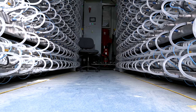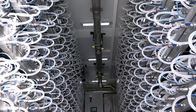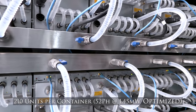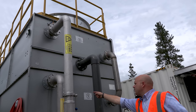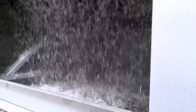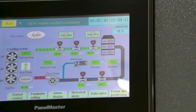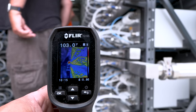Now that we've covered the water purification process, we can open one of these machines and look inside a container. We're looking at 210 units with an inflow of cold water-glycol mix. After it's heated, it goes back out as a hot return over a cooling tower with three phases of cooling — including the shower portion that creates water disturbance, allowing air to cool it — and then back as cool water through the process. We brought out the thermal imaging to assess total surface temperature, and you can see most of the temperature concentrated in the cold lane.